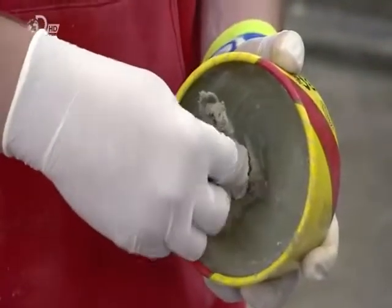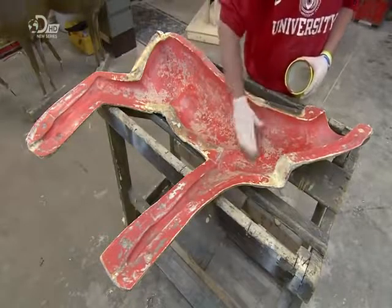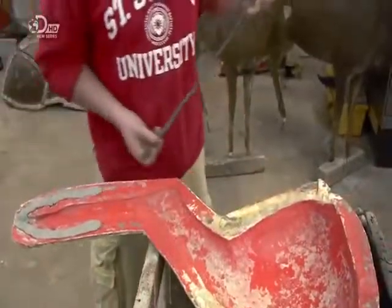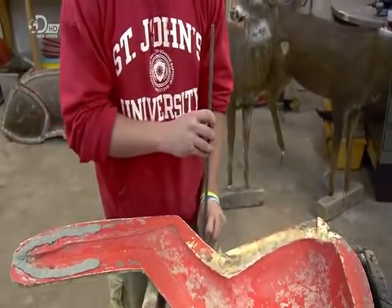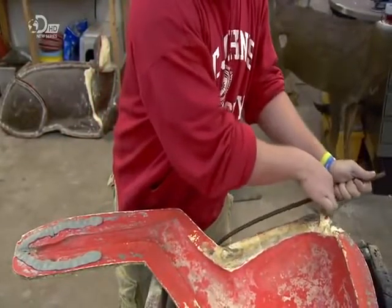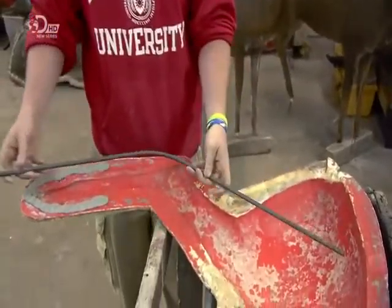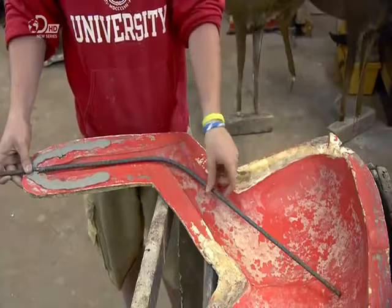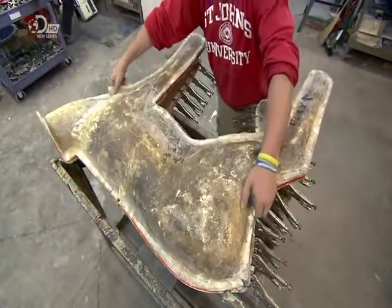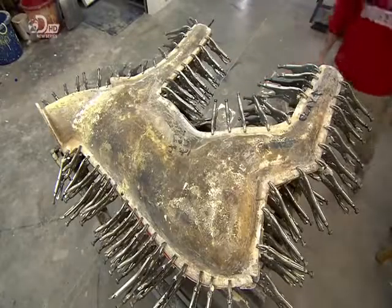At the factory, they begin by waxing a two-part fiberglass body mold. This one is for a deer. Waxing the mold cavity eases the extraction. Steel reinforcement bars are put in the legs. The steel sticks out of the bottom of the hooves to anchor the decoy to the ground. They apply the other half of the mold and clamp all around the perimeter, holding the two parts together.